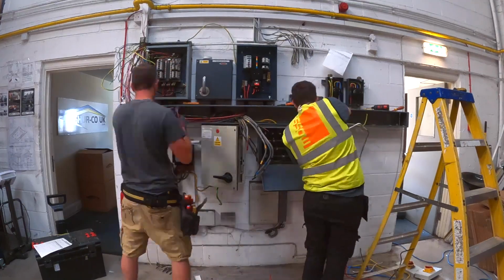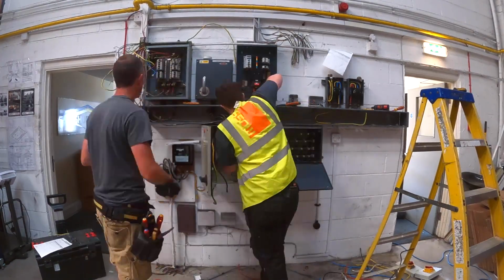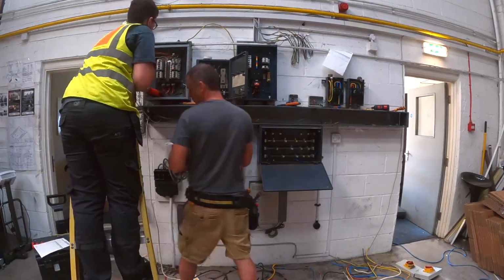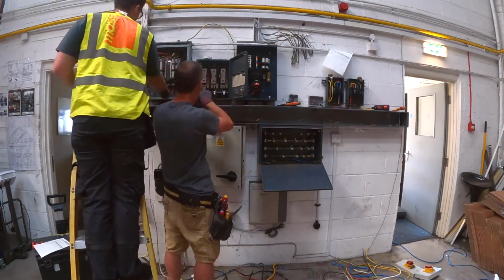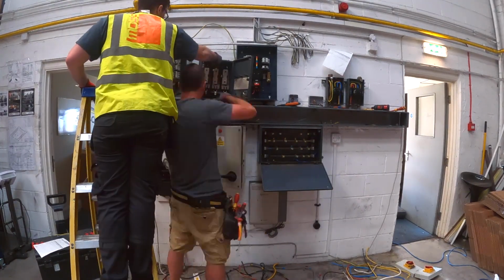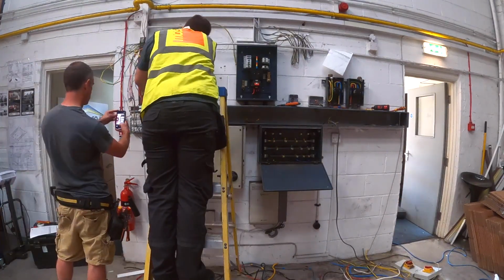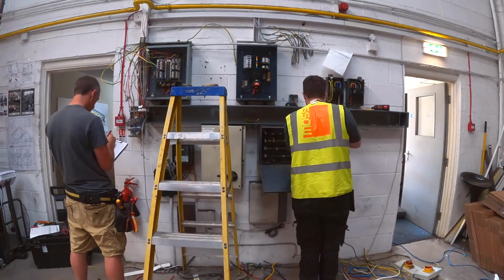Now, I can't actually remember exactly why it failed the EICR or why new boards were recommended. I think in this case it might have just been an accumulation of small issues. I think there were a lot of blanks missing from the fuse boards, no RCD protection, and I don't know if you know these old MEM1 boards, but RCBOs for them are incredibly difficult to source, and they don't make type A ones either. In this industrial unit, on the circuits that needed RCD protection, there would have been a lot of DC components, so adding AC RCDs wouldn't have been an ideal scenario.